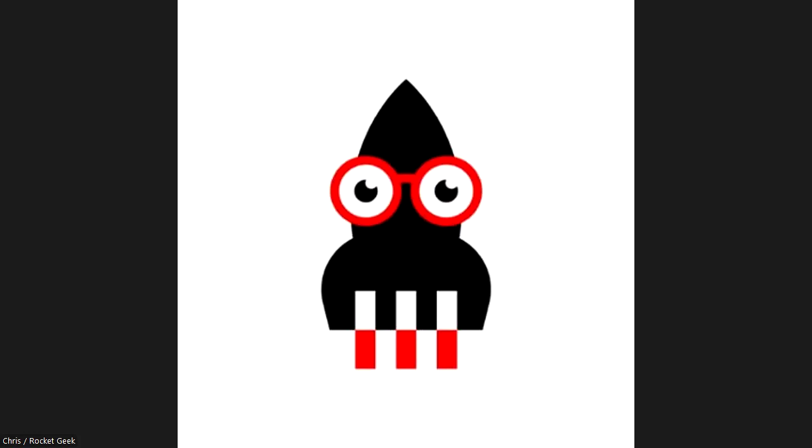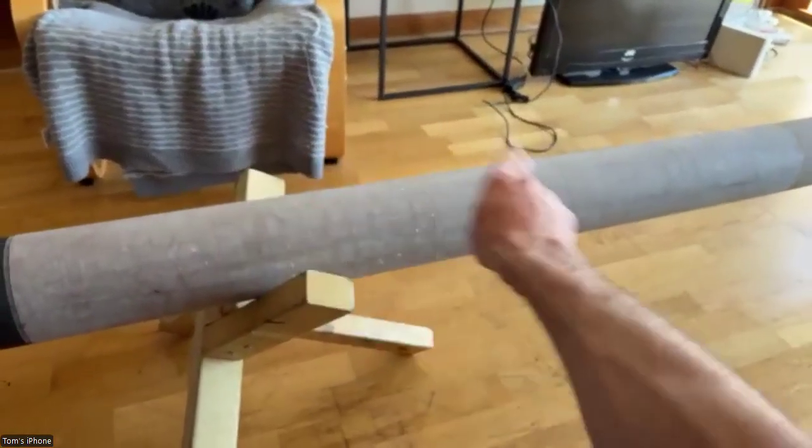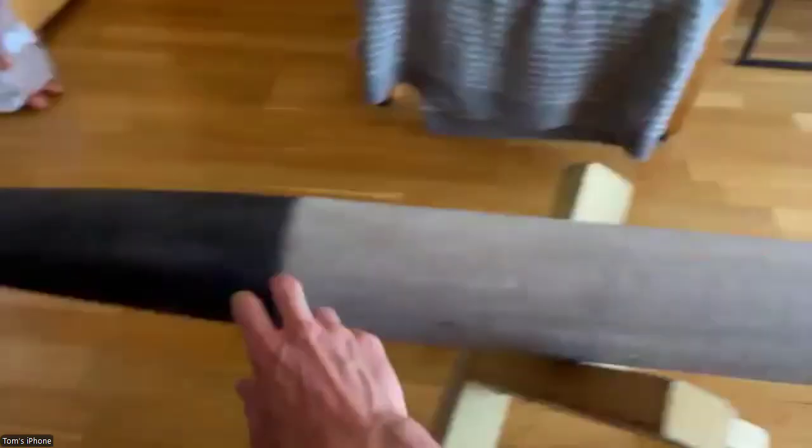Okay. Where are your separation points? What are you doing for parachutes? Traditional, single? So we're doing dual deploy. In here is our avionics bay with charges on either end. The drogue will come out at a separation point just down here, that you can see there, and the main will come out the nose up here.